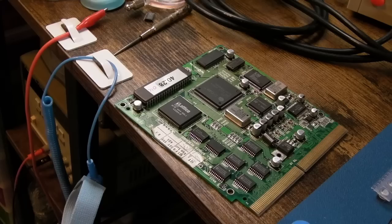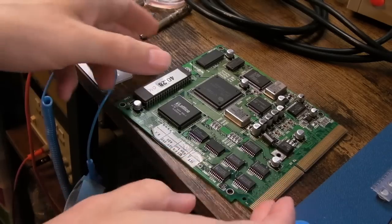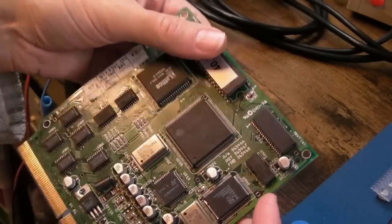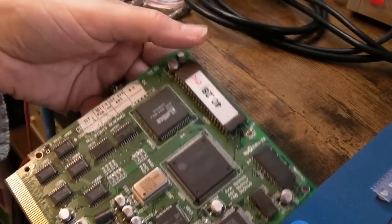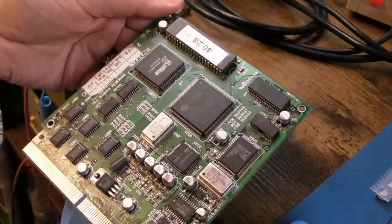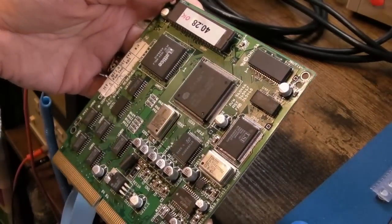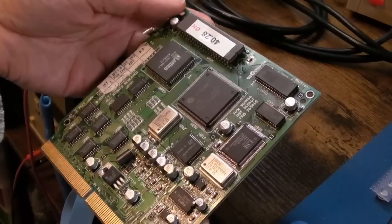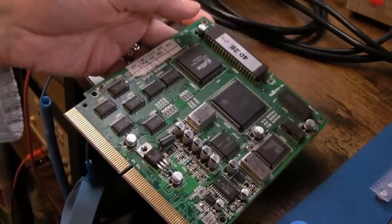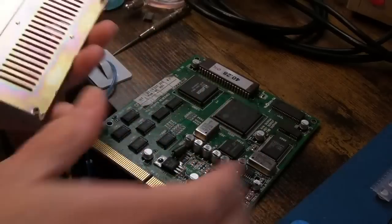While the other one is on test, let me deal with a few things. The RAM I put on the first board is 60 nanoseconds and didn't go on quite as straight as I'd like - I know that wasn't the issue anyway, so I'm going to put the original RAM back. I need to replace the bit of wire with a proper ferrite - there's a bit of wire there on that board and on the other one as well. Here's the shell.